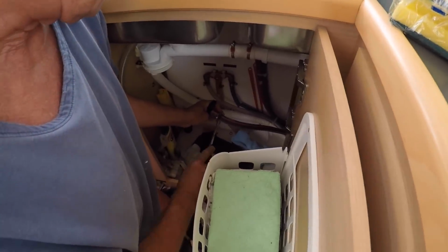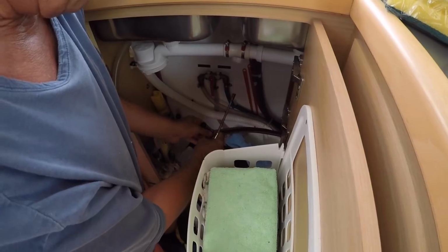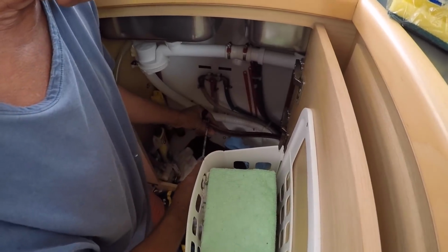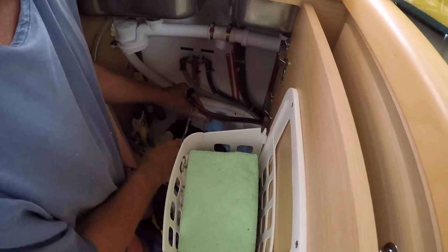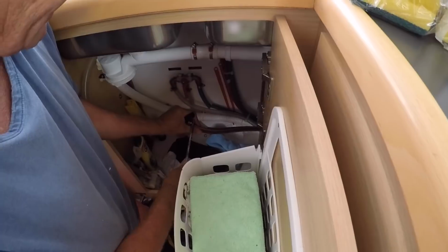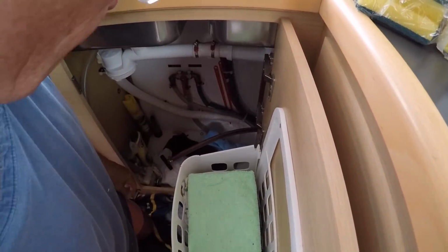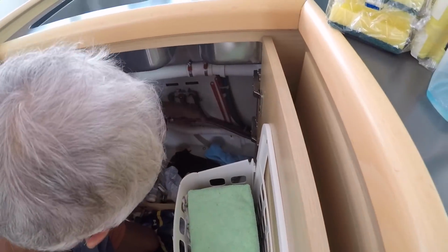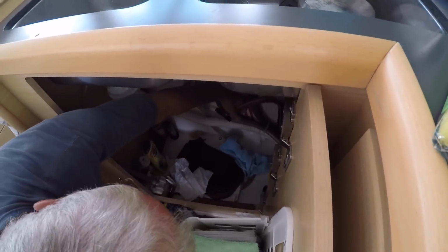So this connection is fresh water. After you've run your water maker, you have to flush it through for about 10 minutes to clean the filters out, so you need fresh water. So again, I'm taking the feed that goes to the foot pump, because that's kind of dedicated, it doesn't do anything. So that's going to go and fit in there.